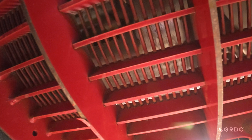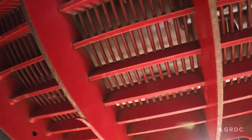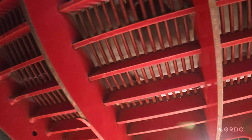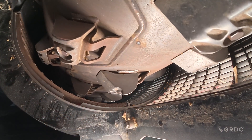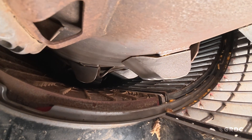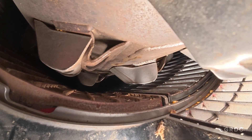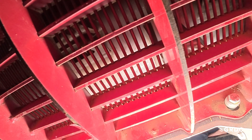How can we stop grain cracking going into our machines? With our concaves and rotor, if the machine is running unloaded or in a light crop, we want it as full as possible to prevent grain cracking. Incorrect concaves in the threshing system can also cause a lot of grain cracking. Rotor speed is another important factor — the higher the rotor speed, the more chance of grain cracking.